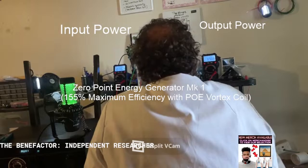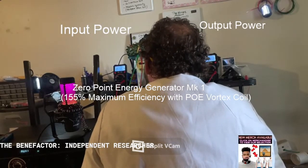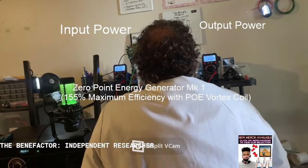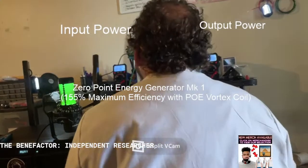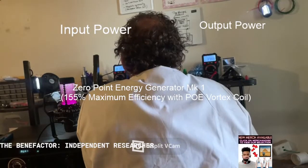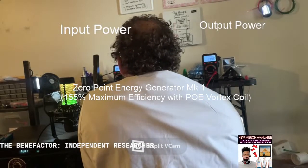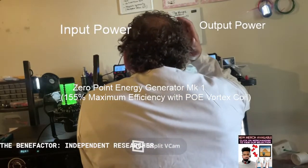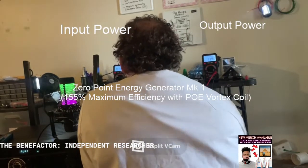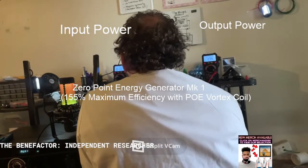So the problem with these multimeters is they're only picking up accurately in one of the settings, and that setting switches depending on what frequency you're in. So I might not be in the right setting. Keep that in mind as well. But I'm trying to figure out how I did it, because I did get a pocket of energy at that high frequency range that was clearly more on the output. But in retrospect, maybe I was accidentally monitoring the amperage. You know, I'll check the amperage as well. It could have been the amps, which would be very interesting, because that's not what's supposed to happen.